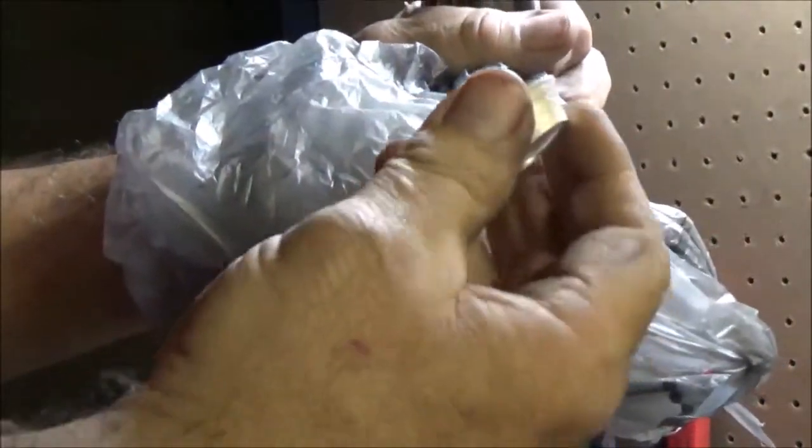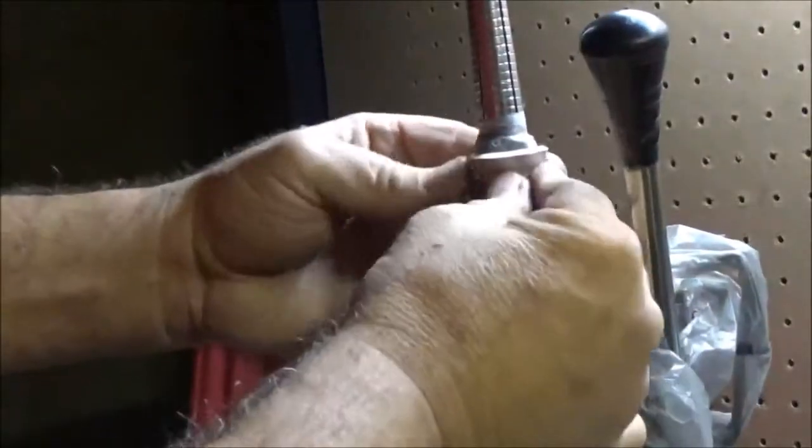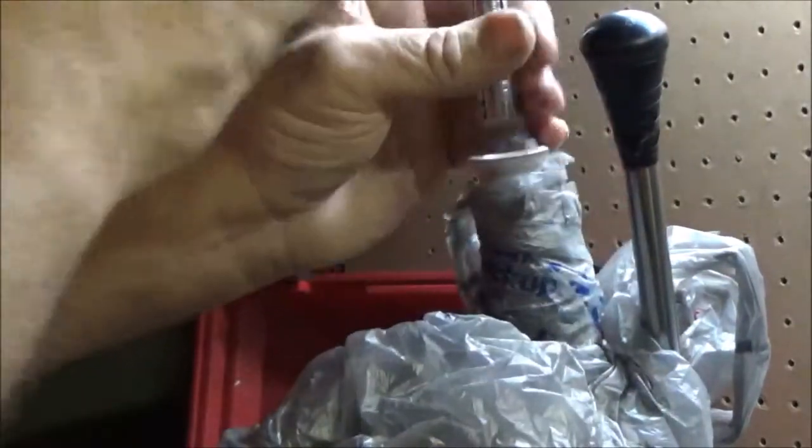We're going to go over here to the ring mandrel stretcher. Try and keep you guys in frame here. If you're wondering what I'm doing, I'm putting shopping bags over the mandrel. What that's going to do is protect the ring from damage on the inside. And we're going to stretch it out. We're trying to get to 11.5 for Lyle. So what we're going to do is try and get it to about a 14, so that we can reduce it down to 11.5.